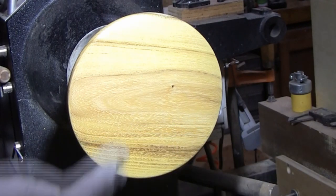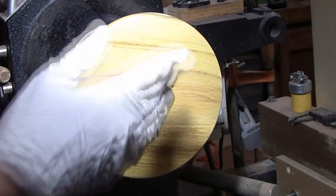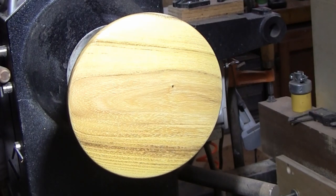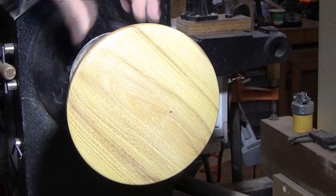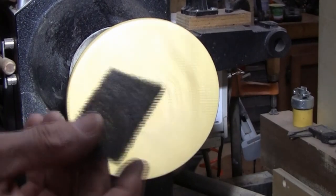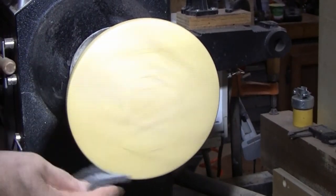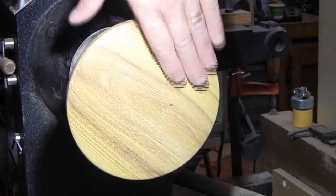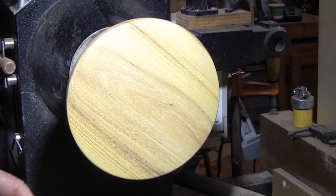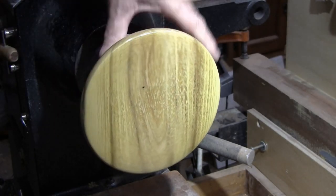It's time to go cook dinner, so I'll let this sit and dry really good, then maybe hit it with 500 grit and do the same thing. I'm able to wipe on as many as two or even three coats like this, then let it dry really good and then sand it. It's been 15 minutes — I went in the house, came back out, and this feels dry enough to work. This time I'm going to use the real fine scotch brite. I probably have six or seven coats wiped on.